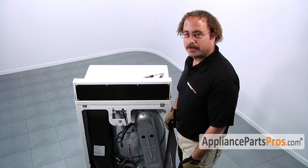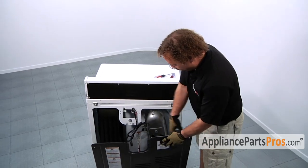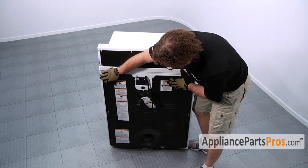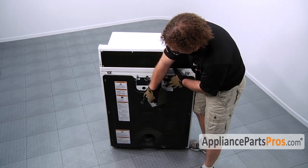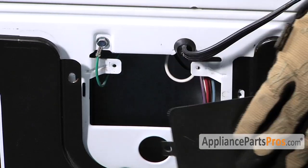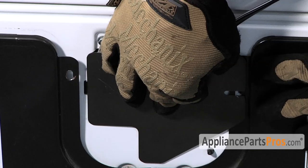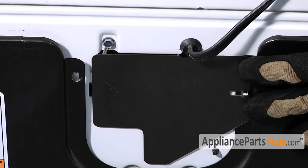Now that we are done with the repair, we can put on the large panel and the small access panel. Go ahead and lift it into place, lining it up and setting it on the pipe. Once you have it lined up, take the smaller access panel, stick that little tab in the slot, and then put this one screw in — that will hold it in place while you put in the rest of the screws.